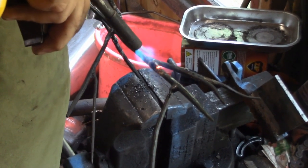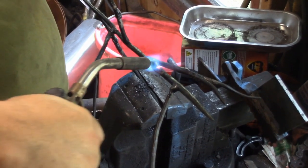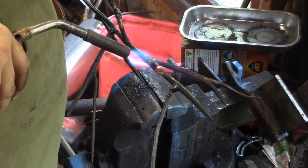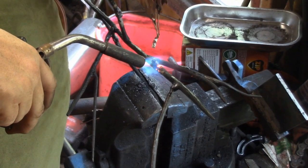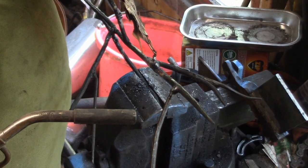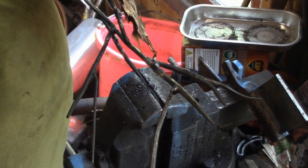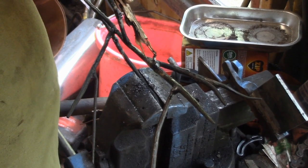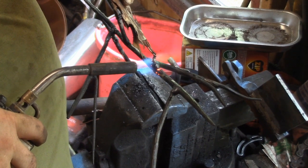The leaf stems are tinned, so this should make a quick connection. The problem is you've got to let it cool — that steel stays warm pretty long. A couple times I took my hand away too quick and broke the solder connection. So give it lots of time, cool it down with a wet rag, blow on it. I broke that connection already — just re-melt it.